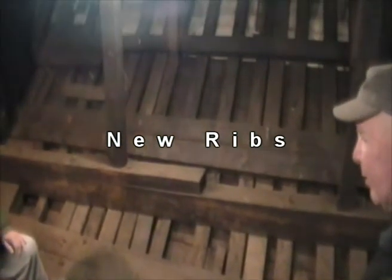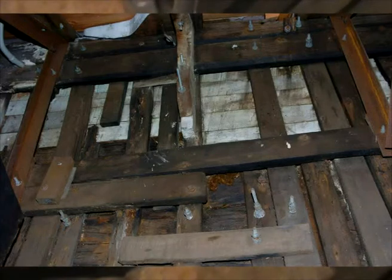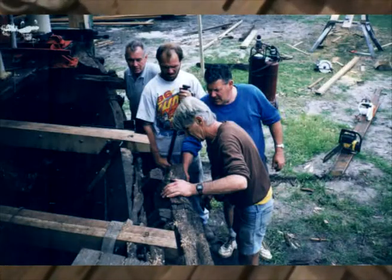When the boat was rebuilt down here, over 170 ribs were installed in the vessel by John Setry and his workers. All the white planking you see up there is New Oregon, obtained from a building site in northern New South Wales. Before it could be moved from the location in the sand to the present location, they had to replace about 60% of the ribs and timbers. They laminated ribs which were steamed and driven in by John Setry and the other volunteers, fastened to new planking.